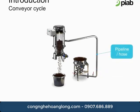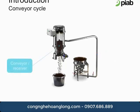Attached to the suction point is then our transfer line. The transfer line is usually either PVC flex hose or some type of hard pipe: stainless steel, carbon steel, or aluminum. Attached to our transfer line is then the vacuum receiver. The product enters the conveyor via a tangential inlet. This then initiates the process of separating the material from the vacuum flow.